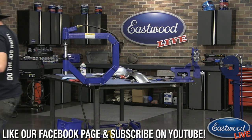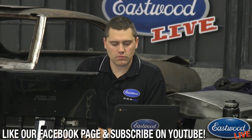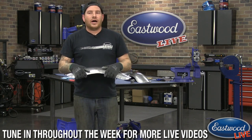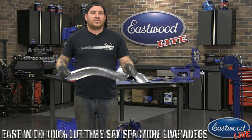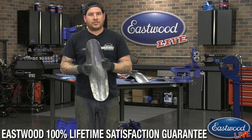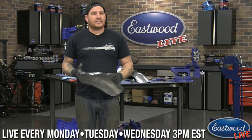Any questions? Sure. Scott asks if you need to change out the dies when going from steel to aluminum. Good question. You do not need to change out the dies. They're all the same. Basically, they're steel dies, so there's no real issue there. The biggest thing is just your pressure. It takes obviously a lot less force to stretch aluminum because it's softer, so you need to run at a lower air pressure when you're planishing. But you can use the same dies, that doesn't matter.